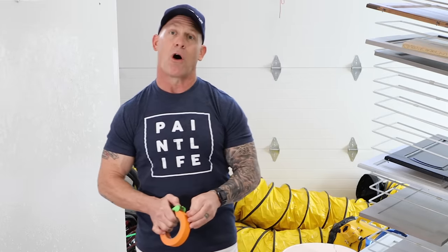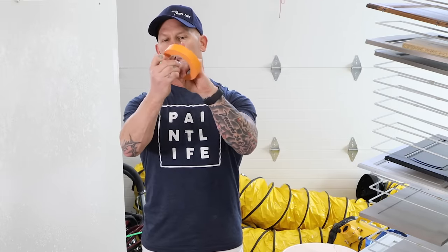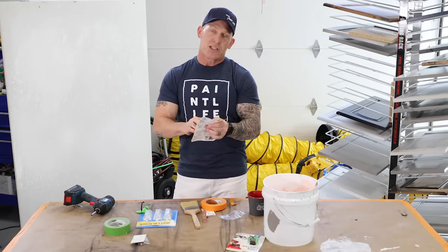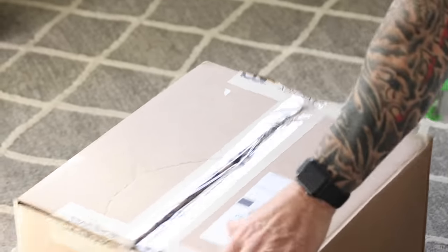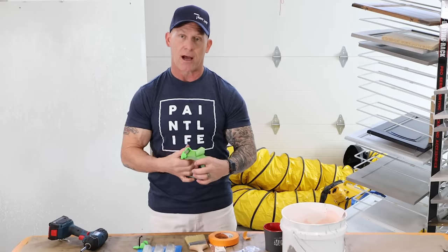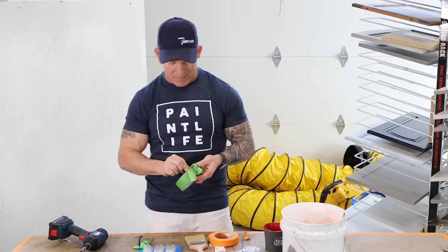So now with your French doors, you can sit there and get perfect 90 degree tears of tape each and every time. I can just go to all my corners on my French door — bam, bam, just hit my corners with this tape right here and I've got perfect corners. Then I'll just take my paper and fill it in. It just attaches right here with this little simple elastic band. It stays on the tape. And kind of interesting — you've got frog tape and tadpole. A tadpole turns into a frog. What a coincidence. They're not owned by the same company though.